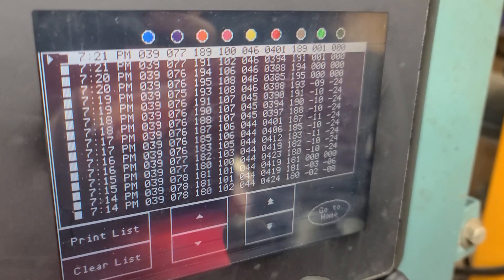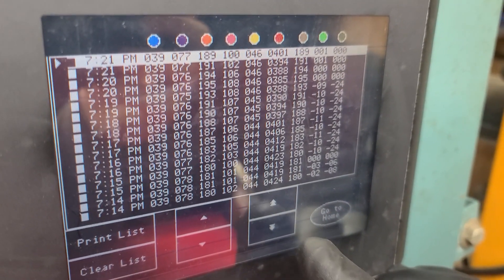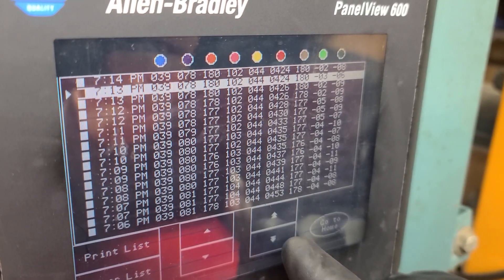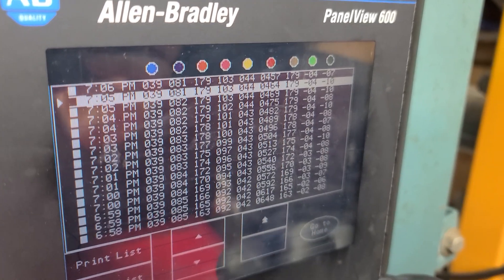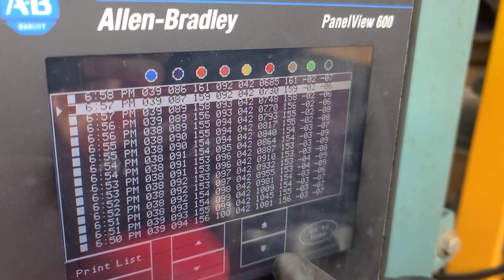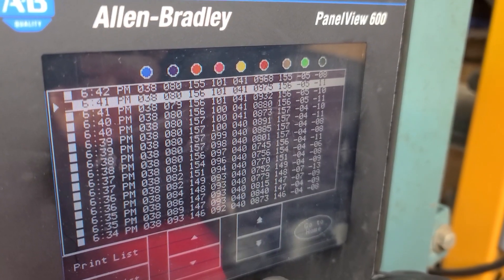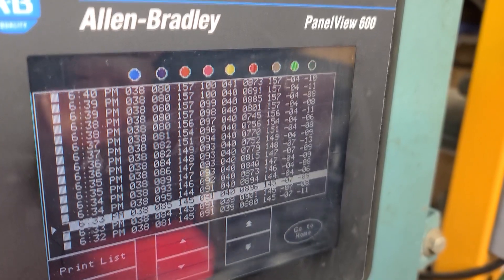Taking a look at our numbers one last time. Hearth temperature's down to 400 degrees. I didn't want to run it anymore — I don't want to make any tar. But at least it breathed good through the end. It goes back to about 632.